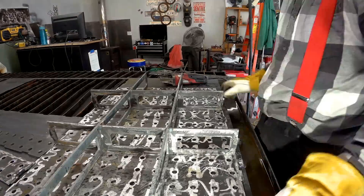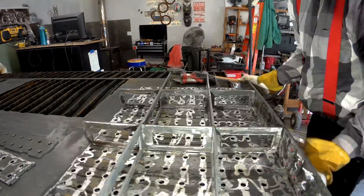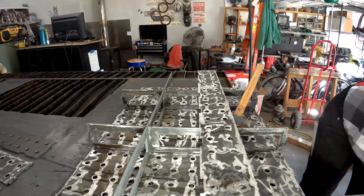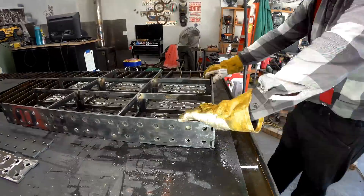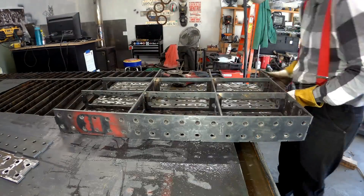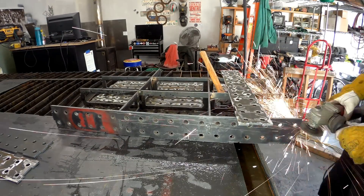I'm trying to make a super flat surface that I can use on a daily basis. The theory is if I draw that top up to those inner supports, it will be as flat as my plasma table can cut straight. As long as I draw it up there tight and iron it, it should be dead nuts.